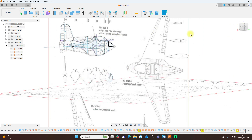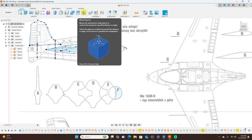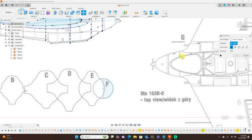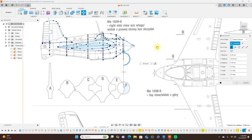That's going to go up here, and to move it there, all you do is click Move/Copy and change this to Sketch Objects. It's important that you select the right point — you want this point here, because we're going to move this, and the center line is what all the other formers are based off of too. Then you just move it to wherever you need it to be.